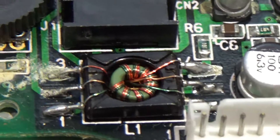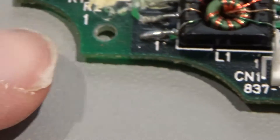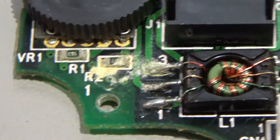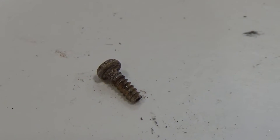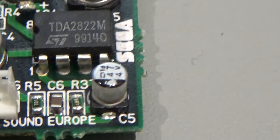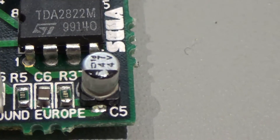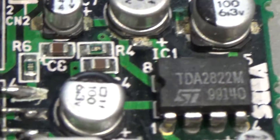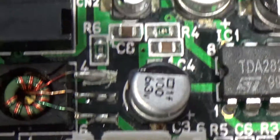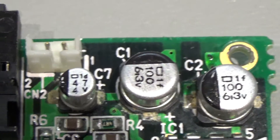This is the current state of the soundboard. We've got large amounts of corrosion there, and the screw I took out has got loads of corrosion on it as well — I'll have to clean that screw. That cap there, C5, looks like the only one that hasn't leaked, so that one looks alright. The others have all leaked though — that one is hard to see but it has leaked. That one's leaked, that's leaked, that's leaked.